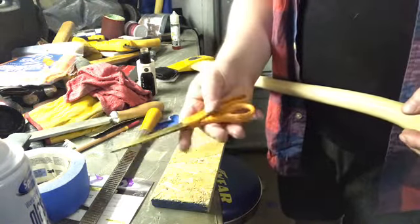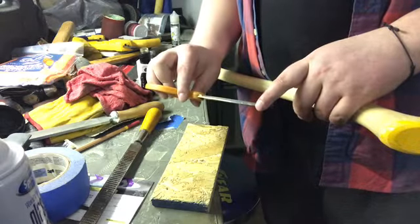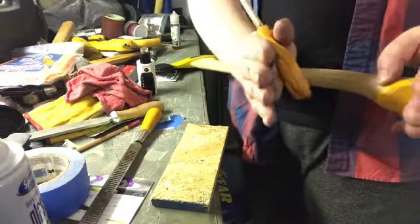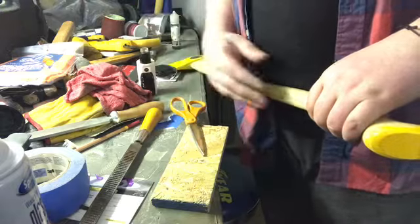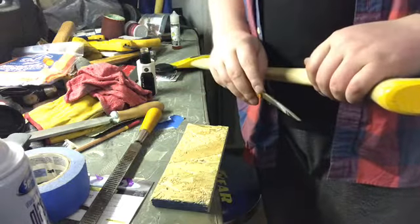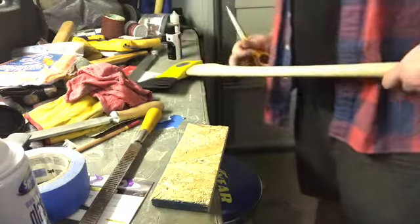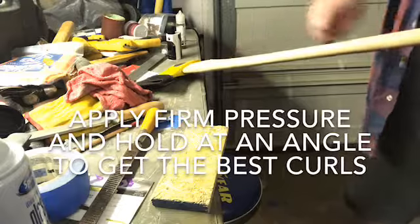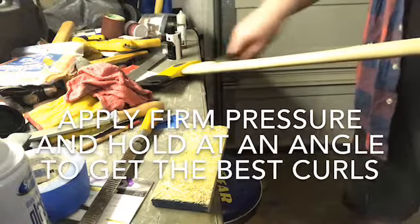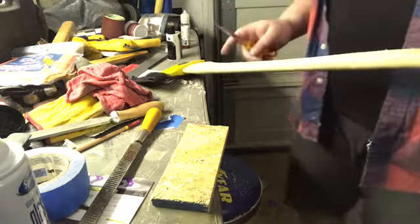If you've watched my previous videos, I usually use a pair of scissors. You basically just file this flat on top and then file the sides flat so you have like ears pointing up, then you take a screwdriver or a harder piece of steel and burnish that, which flips the burr over and gives you that nice hook that you need. Scrapers are really helpful.